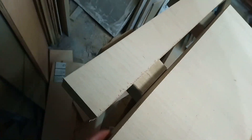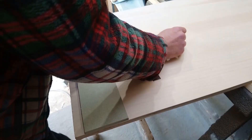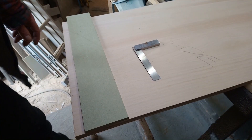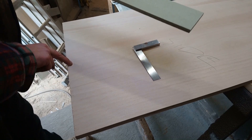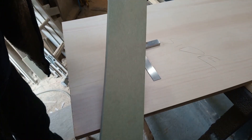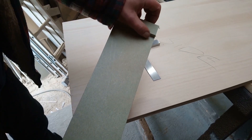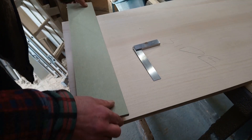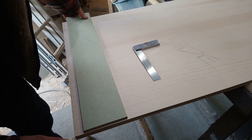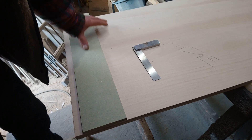My saw is cutting pretty square — I don't adjust or tilt it, I set it up square and it stays that way. So now I'll make a single cut across at the length I want and another cut over there. I've got my square end — it's neat on this side but broke out a little bit because I had the track on this side, but that doesn't matter because it's the back. This is one of the side pieces, one of the uprights — it's the back side. I'm going to mark it with big letters. I'm going to put biscuits in the end, just three, and get some screws in between. I'll cut myself a jig — a square piece of timber cut to exactly the right length.